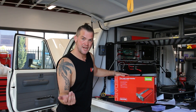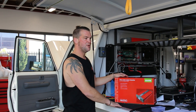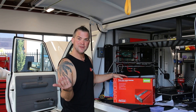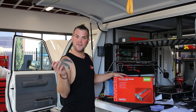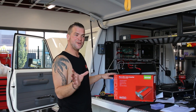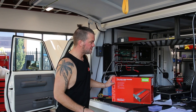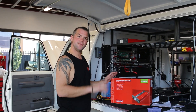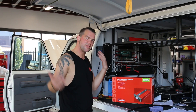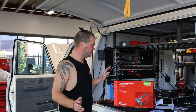To give you an idea of what that means: if you've got a 1000 watt appliance, you put about 25% on top — that's 1250 watts — and then you look for the inverters available. You can usually buy a 1200 watt, but that's a bit too small. The next size up is 1500 watt, and that will do it. Or if you want to leave yourself some wiggle room for the future, choose a 2000 watt unit.